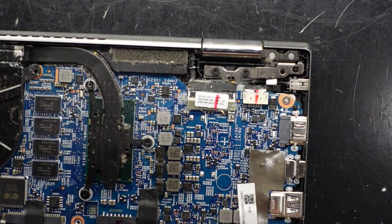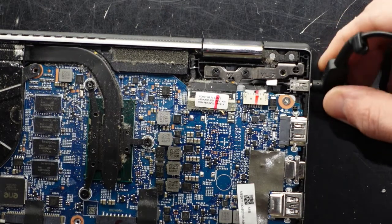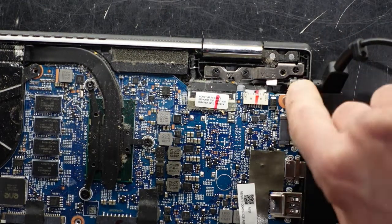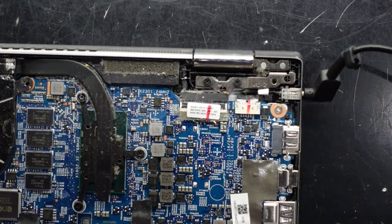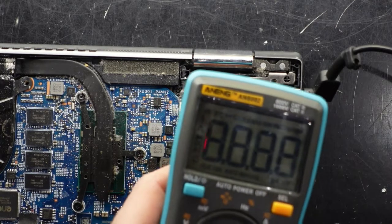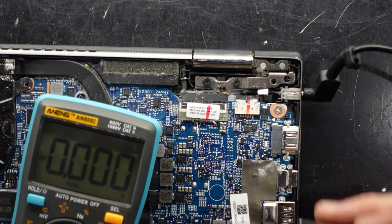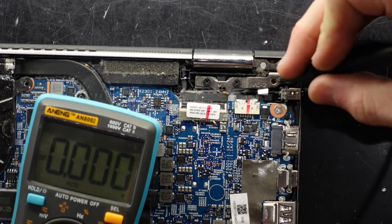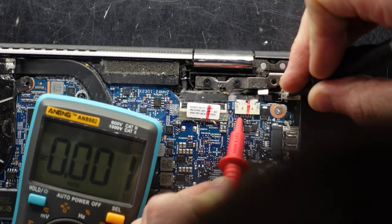I'm going to plug some power in here, which I'm assuming it won't turn on. But before I disconnect and try a different power source, I'm going to use my multimeter, stick it on voltage, and from here I'm purely going to stick this on an earth point — chassis will do — and work each pin individually.